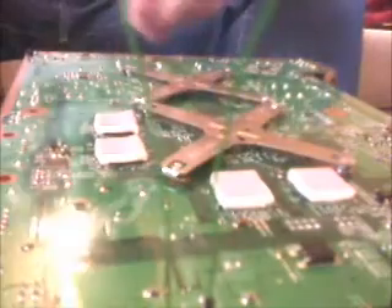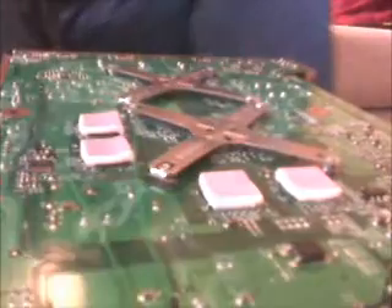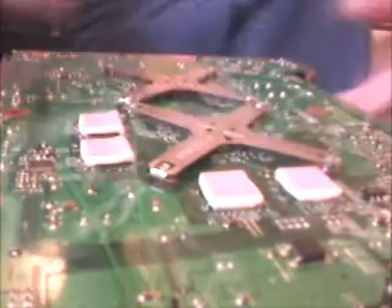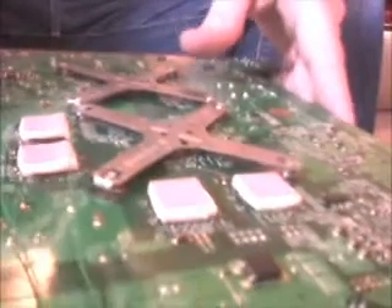Once you've done that, you can gently bend these back nice and flat, and we can now solder to the other part of the board. I'm doing all this from the underside of the board — you'll find that all the diagrams online show you the top view, so you need to flip everything as if it's a mirror image. I'll put up a diagram and a photo at the end showing everyone what points go where.